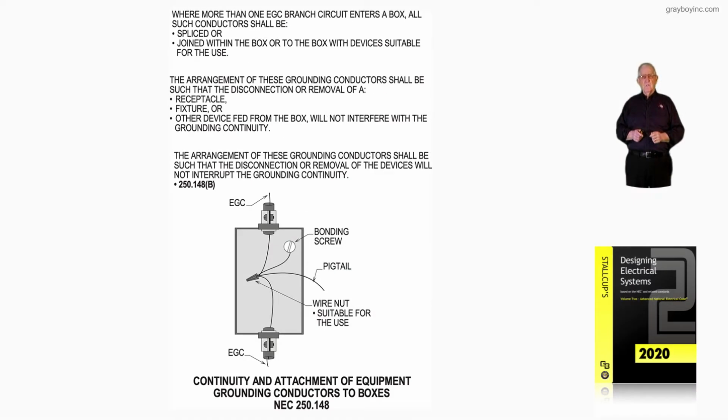Now, this illustration deals with isolated receptacles in accordance with NEC 250.146(D) as in dog. Reviewing the note first, the note states for hard wired electronic equipment with a non-metallic spacer between the equipment and the raceway, see 250.96(B), as well as figures 16-99 and 16-133.